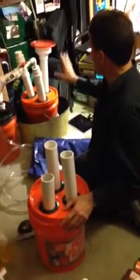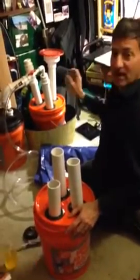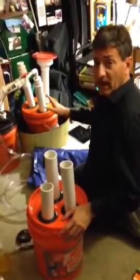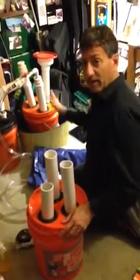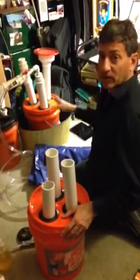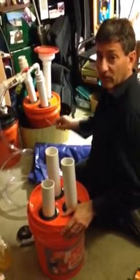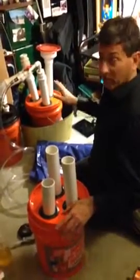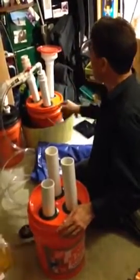You would feed this about a cup of food waste a day once it starts producing biogas. Don't feed it before that. Start with inoculant, which is either from a biodigester that's working, or go ahead and put some animal manures in, let them sit for a couple weeks. Once it makes flammable gas, because it'll first be CO2, then you can start feeding about a cup a day.